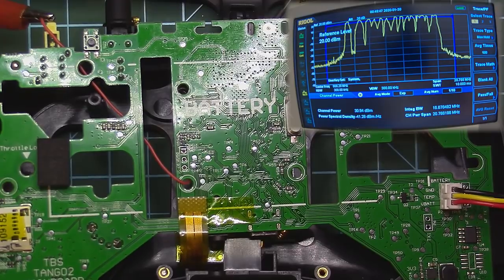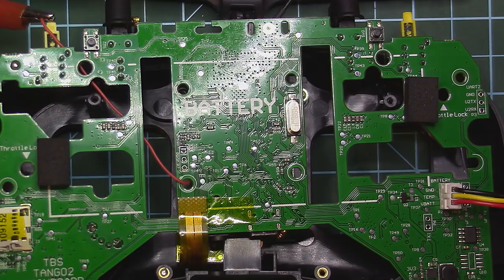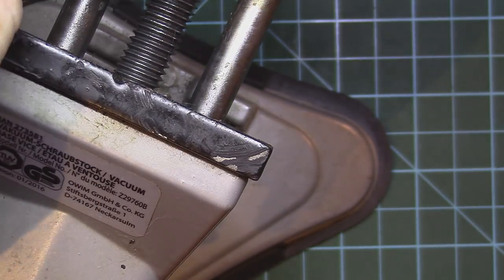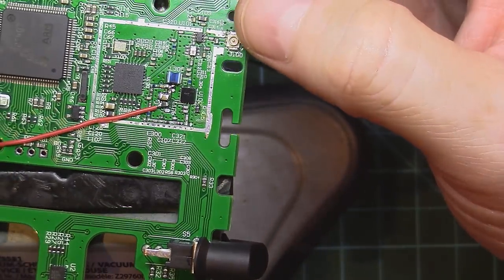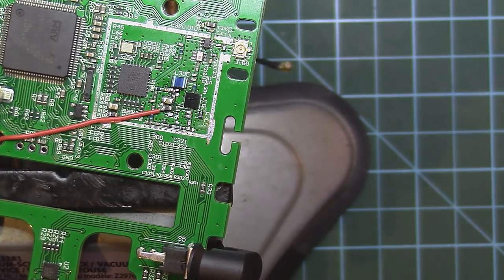I suspect we did. Well, we are very close to 500. We have 34.7 and it will rise a bit more. So I would say we are 3 dB over what we had when we started. We had around 31.89. So after many tries, I decided that I will use the 1.2K resistor that was initially on the board. And that's because the power output increase was almost zero.